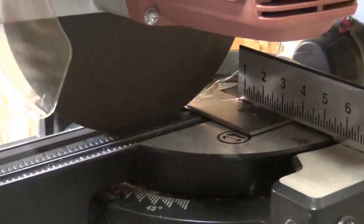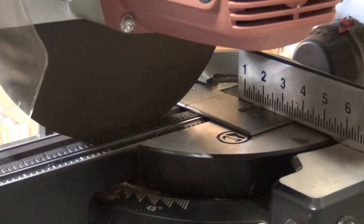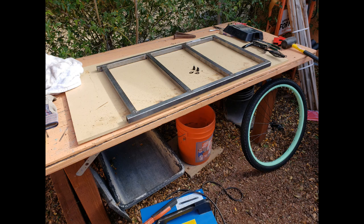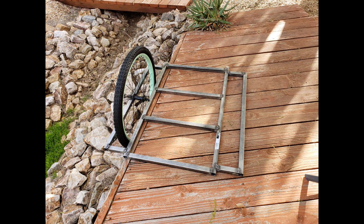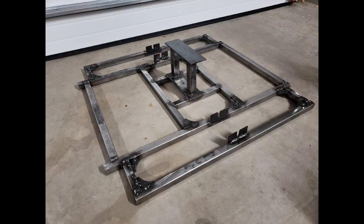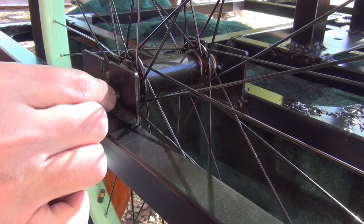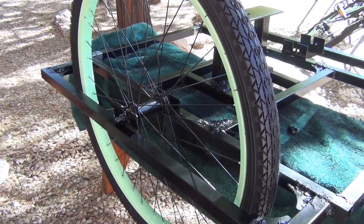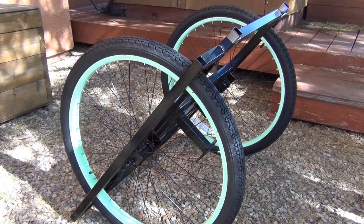Here I'm showing some various techniques of how I worked the steel. After laying out the design on paper, I started welding together the base frame for the cart itself. I actually got some of the measurements from documentation I found online from other manufacturers. One hint I got was to build the cart narrow enough to fit through a standard 34-inch doorway. Here you can see how I rough fitted one of the wheels, and then the completed frame upside down, showing how I attach the wheels with just a standard bolt. I manufactured the bracket that is attached to the frame, and here we have the finished cart frame and wheels.